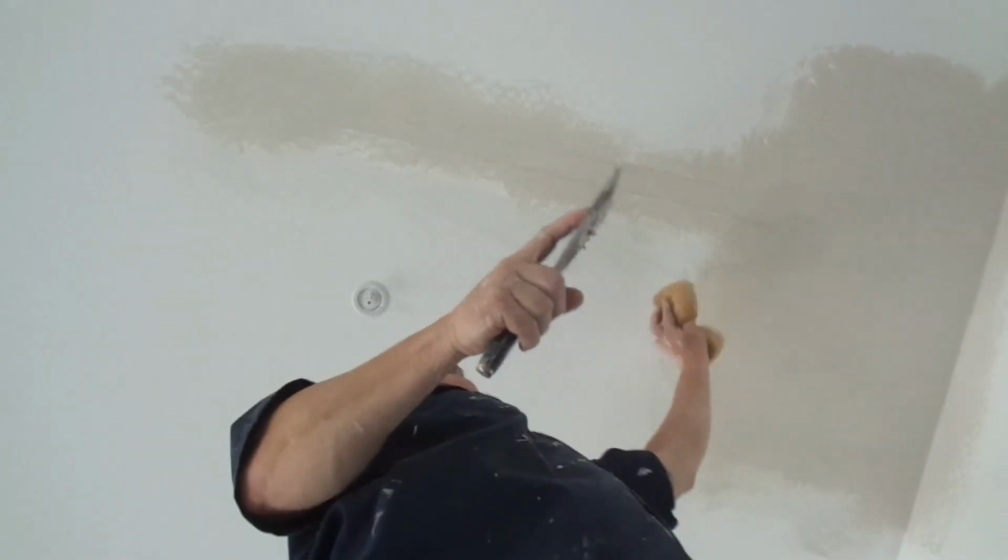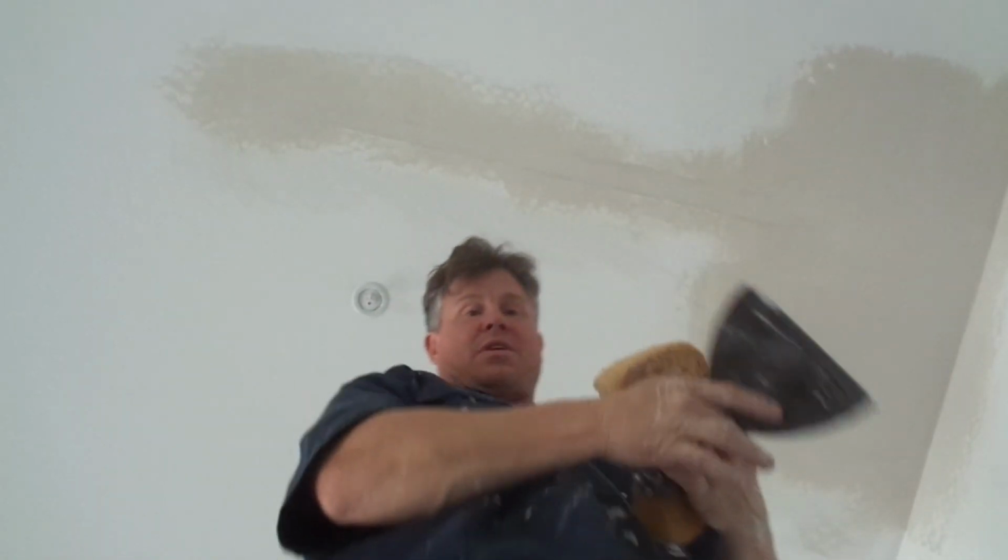This slicked out. This is a good first coat. It's almost like a second coat here. I can turn around and texture this, but I'm going to follow through with a tight coat. Either hot mud, I might even do a joint compound. Since I'm going to texture it with a red line joint compound, I can do a tight coat of joint compound for a second coat. That's because my first coat's good. I could texture it as is because I put the mud on just right and I slicked it out just in time. There's extra mud on there. That's what I was taking off, extra mud.